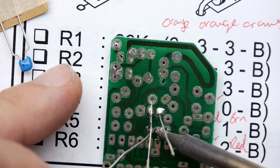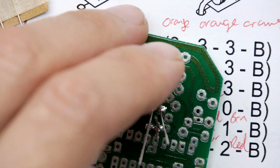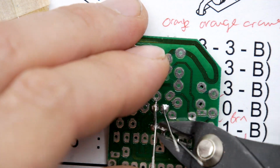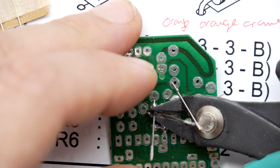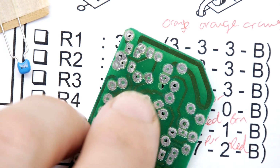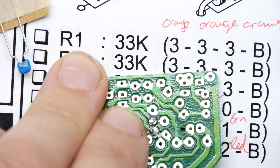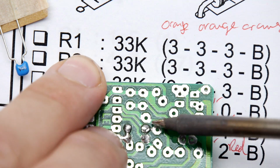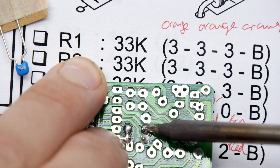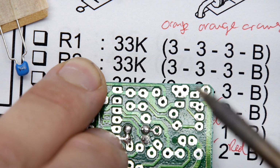Pay attention now where you can to where they're on the same signal, so that way you'll know if they've jumped over and made a bridge or if they are where they're supposed to be. I'll give you an example. You see there now, I suspect it's still a single-sided board, so I suspect they're supposed to be connected, but see, I'm just going to rub the soldering iron over there just to make sure, and they are. You can see the trace there between them.